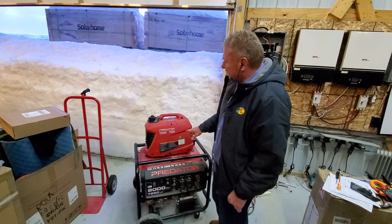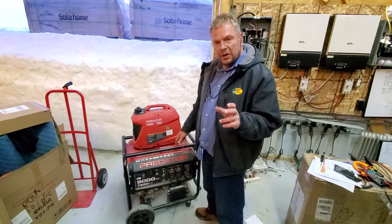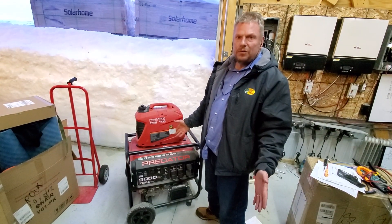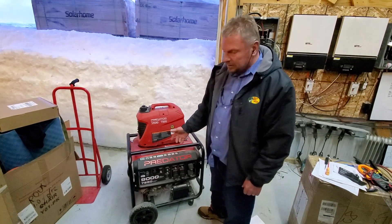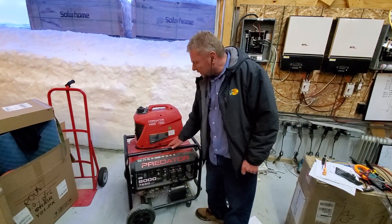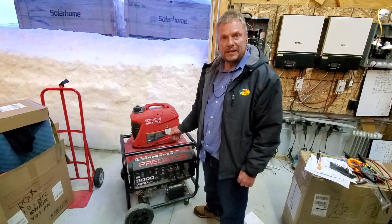An inverter generator has an inverter inside it to give you a pure sine wave at exactly 60 Hz. A non-inverter type generator can give you an ugly waveform which can sometimes cause the inverter not to synchronize properly. The frequency needs to be between 58 and 63 Hz. People say their generator ran fine for months, then suddenly in winter or summer it stops. The grade of gas might have changed, the temperature of the generator might have changed, or you might need WD-40 on the governor. Many things can cause a generator to lose synchronization or fail to maintain proper frequency. This firmware update makes the inverter less sensitive to generator noise.